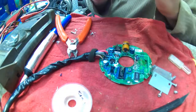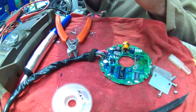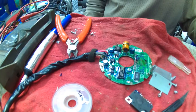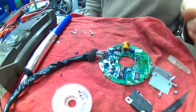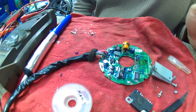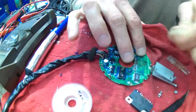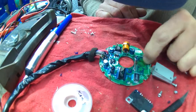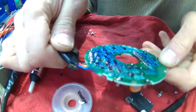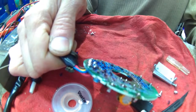I've got to get some of that conformal coating off of it - I've got it goobered on there. The part number is 6AM15. Yep, looks like it. Those can be had - the original ones still can be had, looks like slow boat from the usual scumbags, or we may have converted to a different one that we can get at DigiKey. I'll see about linking those in the description. I'm going to try to order some of those up. You can tell mine got hot - look at that. But the board still looks good; I don't think I lost any other parts off of it, so hopefully we're going to give that a shot. Stand by.